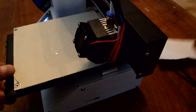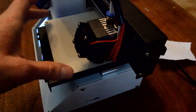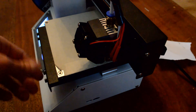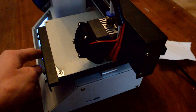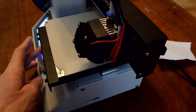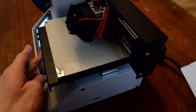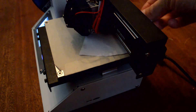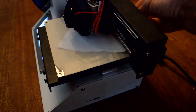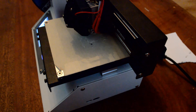Now the last check — you should really go back and forth between all corners once or twice before running a print, because getting the bed leveling right is important. I'll move the X-axis to the middle approximately, since that's where prints start. There's a little bit of resistance on the paper right there — it's pretty much leveled. That's the way I do bed leveling on my 3D printer. Thanks for watching.